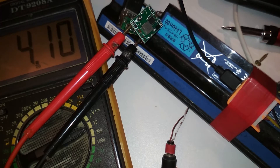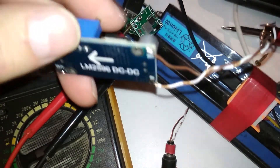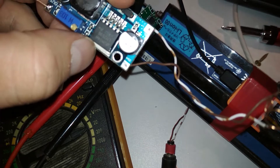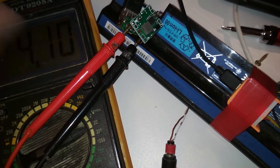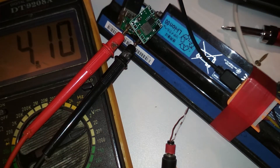That means the real limit of this circuitry is like 500 milliamps, and that is really bad — because the bigger one can support three amps. In price they are very close; the bigger one is just half a dollar more expensive and can do three amps with all those big components and a more serious chip. So I have to give it a fail. I will leave a bad review for this.